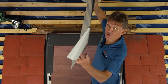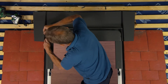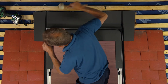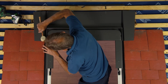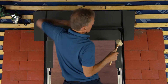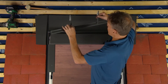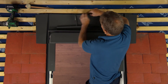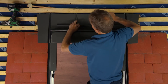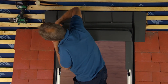This is the top apron — or as I call it, the back gutter. It goes on and you'll see it's a very nice tight fit. If you've got any space between that flashing and the tile, just tap it down into place. Now I've got the tilting fillet, which basically just gives somewhere for that bottom course of tiles to sit on. We're going to put the screws in the side to hold that top apron in place.